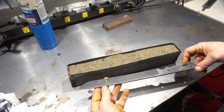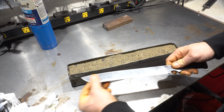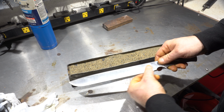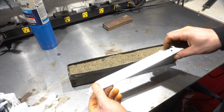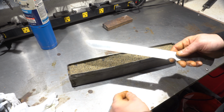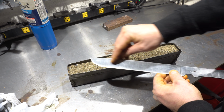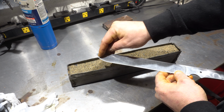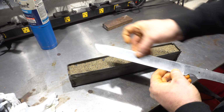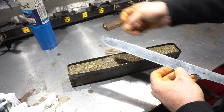Okay, I've got the blade pretty much finished. It's been belt sanded to 400, and then I took a surface conditioning belt and just smoothed it all out. I think it looks really good right now. The next step, and one of the most vital steps, is blue backing it, which means heating just the spine, probably the top 3/4 of it, with a torch until it's blue, and this will basically take the heat treat out of the top and make it flexible.